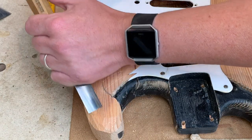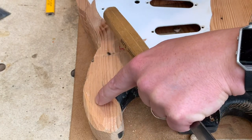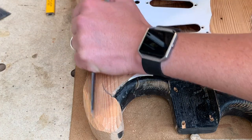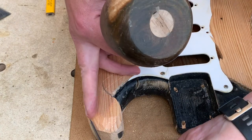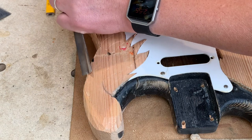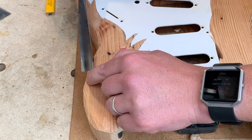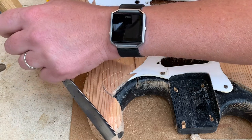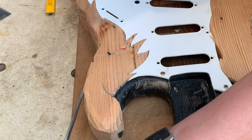We also need to think downhill in relation to the grain lines that we have here as well. So notice along these edges, I'm carving down in relation to those stripes. I'm not carving that way because again, that would split those grain sections off. So from here, I don't want to be coming in like this because that will split off that whole section. So as I've carved downhill from there, at this point, I would need to then switch to here to carve downhill into this area.